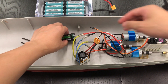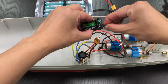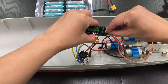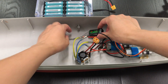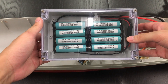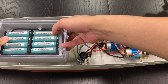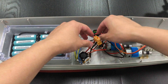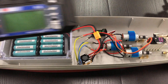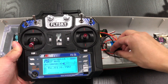To achieve the basic steering function, we arrange a 55-gram servo connected to the first channel. For the accelerator, we connect the ESC to the second channel — the signal wire has been connected. For the power battery module, we applied a dedicated waterproof electric box to contain our 18650 lithium-ion battery, placed in the middle front and connected with the ESC. Now we start the pairing procedure — switch on the controller as well as the ESC.